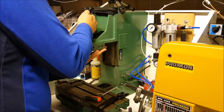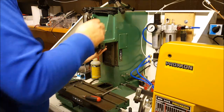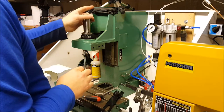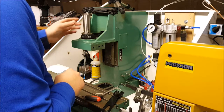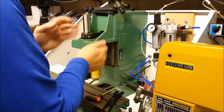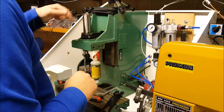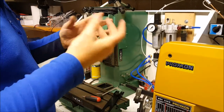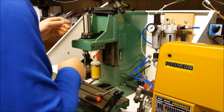A little bit perturbed as to why that is as tight as it is. What I had to do is — the internal bore of this isn't all that well prepared, to be honest. I assume when they supplied it they thought, 'We're not going to be putting anything moving in there, it's got the fixed drawbar, so we won't polish it off.' I did spend a bit of time with just a flapper sanding thing in an electric drill, washing it up and down inside just to clean all that up.